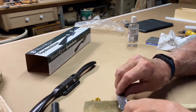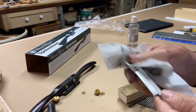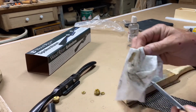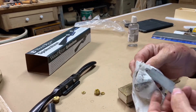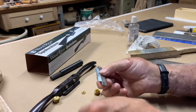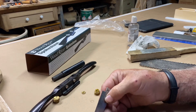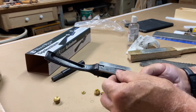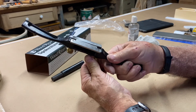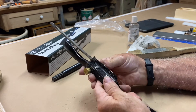The last thing I want to do is hone this. I've been doing this for about 15 minutes, sharpening with 300 and then 600 grit. It can be sharper, but I just wanted to see for myself if the reviews were correct that it was hard to sharpen. I found it harder to just figure out how to get it apart. Now to get it back together — were these on the top or the bottom? I'll put a pretty thin throat on it this time. I think once I dial this in, I'm going to really like it, but getting it dialed in is a great learning process.